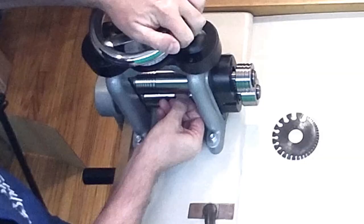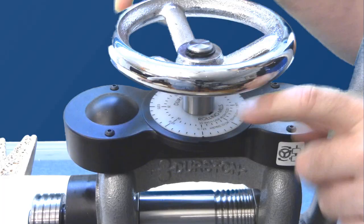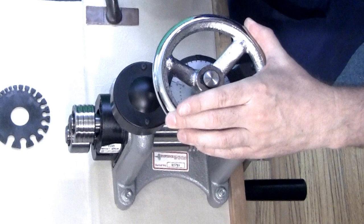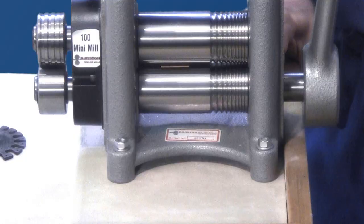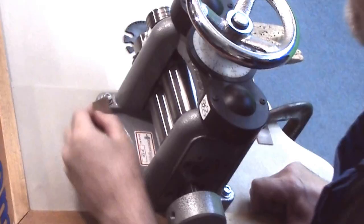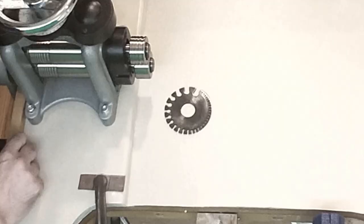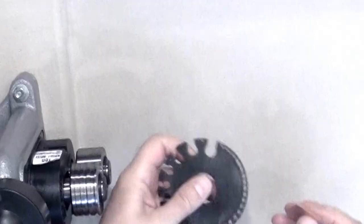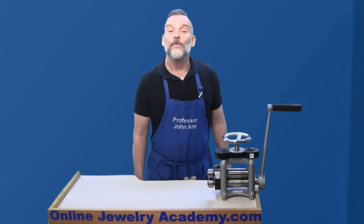Note the number on the calibrated dial in the front on the arrow nearest you. Then loosen the rollers with the top wheel and remove your sheet metal. Now you can turn the top wheel back to the position that you previously noted, then turn the top wheel a bit more to slightly decrease the space between the rollers. This will leave enough of a gap to crank the copper sheet through the rollers to decrease the overall thickness. Without making any adjustments, flip the sheet metal over and crank it through the rolling mill again — this should help to maintain the flatness of the material. Check the thickness of your sheet using a gauge wheel and continue the process, re-annealing whenever necessary until you achieve the thickness you desire.